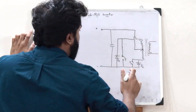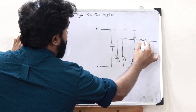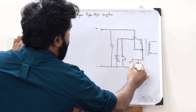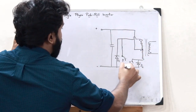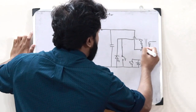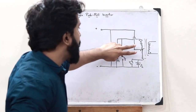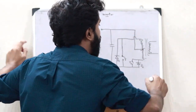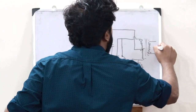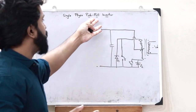Next, let us see the case when we turn on switch T2. When switch T2 is turned on, current starts flowing through the circuit. When it reaches the junction, it cannot pass through the other switch because that is off. So the current passes through the other particular coil and completes the circuit. Plus is connected on one side, so plus polarity is obtained there, and minus is connected on the other side. Because this has a plus-minus polarity, the inverse polarity gets induced in the secondary winding, and therefore a minus V0 is obtained at the output. This is the basic working of a single-phase push-pull inverter.